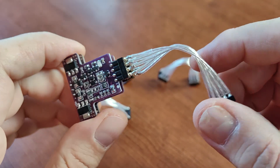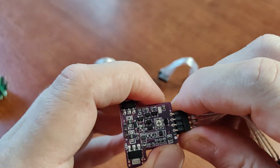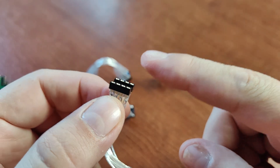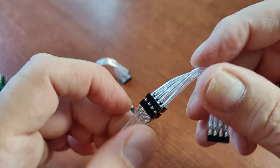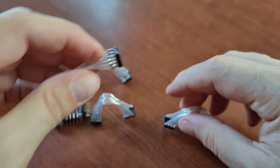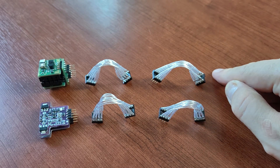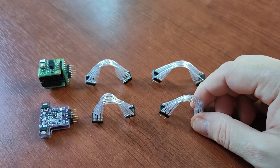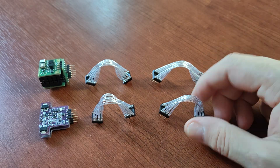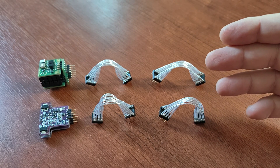The second tip is for getting your operational amplifier just a little bit higher on the PCB board — you should also order a couple of loose DIP sockets. You can stack them together, one on top of another like that, and two of them will give you an additional four millimeters of clearance from the PCB board. I have four of them for testing equipment, and I also have a set of loose DIP-8 sockets which are very cheap. You probably can't buy them in amounts less than 10, but they work, and they're a little under four dollars.